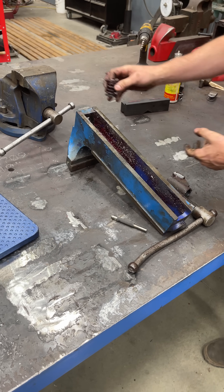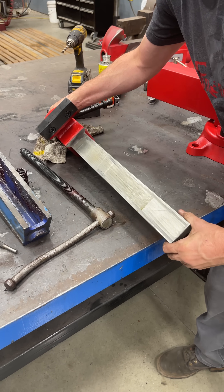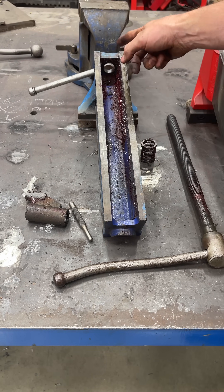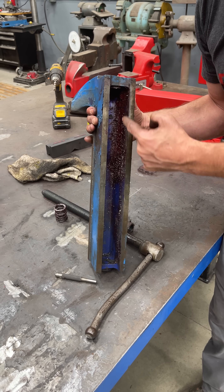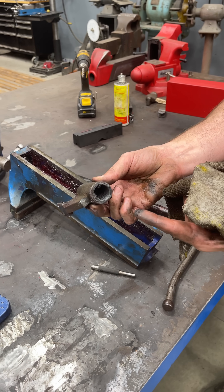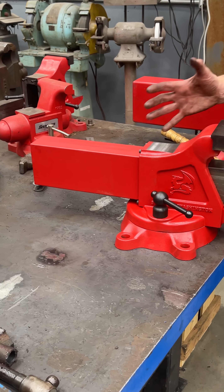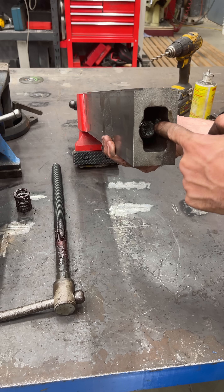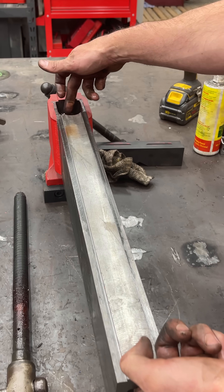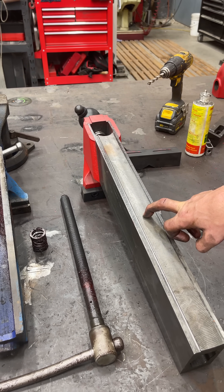There's one slide. All we have to do to see the slide is just unscrew it. Look at the way this is made — completely two different designs. One is a C-shape where all that crud can get inside. See how yucky it is? Look at the screw because it's open to the elements — look at all the stuff that screw wipes off. It really makes the vice not fun to operate. The hardtail is covered — it's completely sealed, there's no way that gunk can get in there. This one is four-sided, and the opening right here is one of only two entrances for stuff to get in. The slide is completely sealed off from the elements.